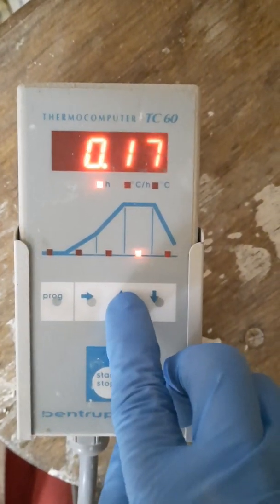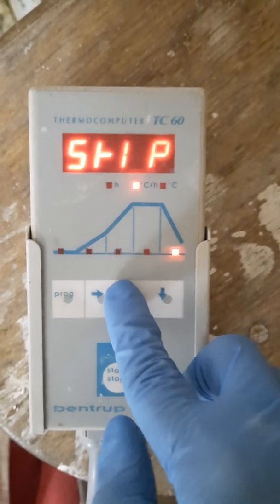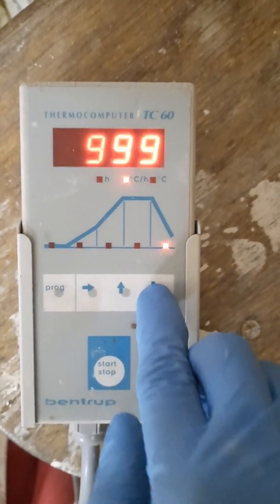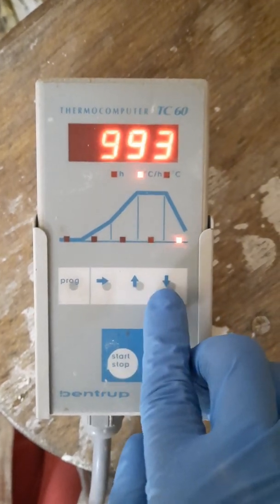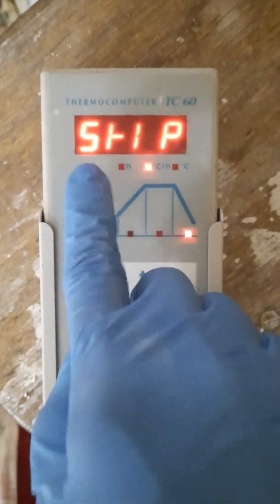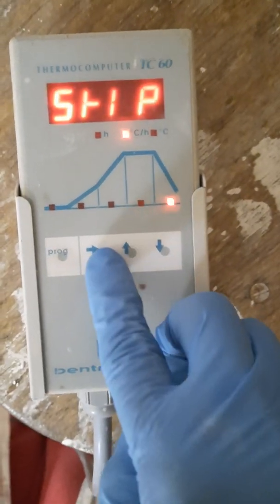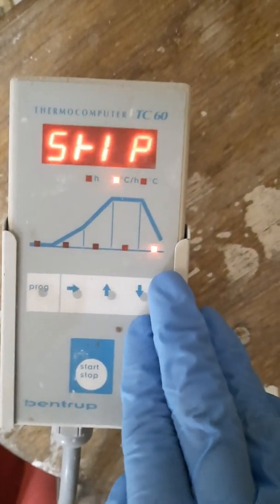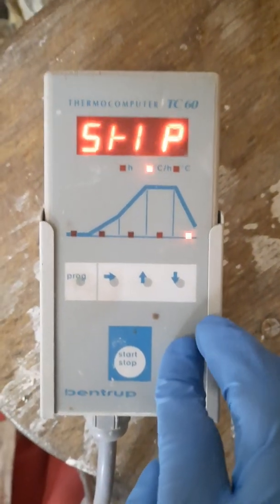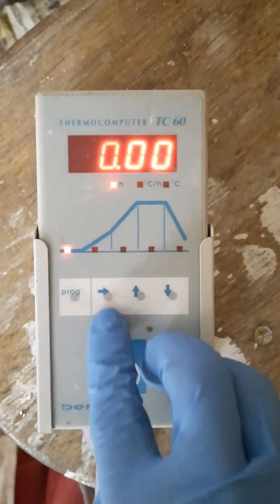15 minutes soaking — you can make it higher or lower. For skip cooling, you press the down arrow and you can set controlled cooling. As you press that it will say skip, which means it is not going to be controlled cooling. If you want, it can do controlled cooling for things like a crystalline firing. By the way, this is not a controller that will cool or do a soak at a certain temperature and then drop back down — so this might not be suitable for glass. I have not fired any glass in here at all.